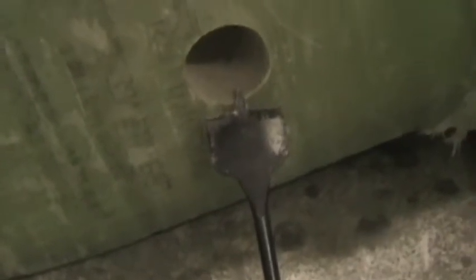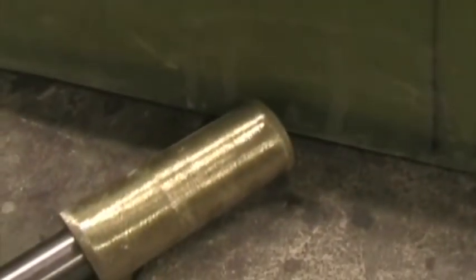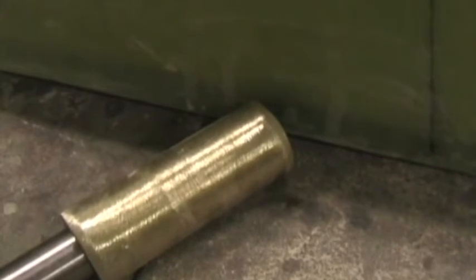We've now drilled the 40mm hole for the wing bush using that spade cutter. Drilled a pilot hole from either side, made sure that they connected, and then drilled through. The idea is to have the hole slightly bigger than the bush so that there's some space for the cotton flock around it. Approximately a millimeter, and that allows you a little bit of latitude in setting up the incidence ultimately.